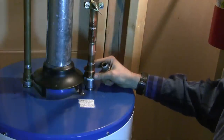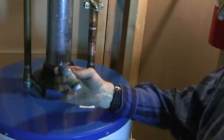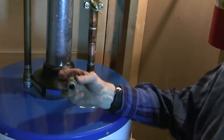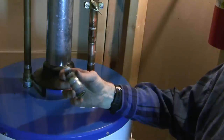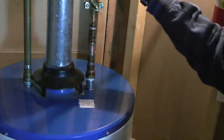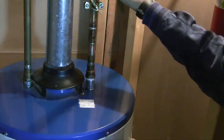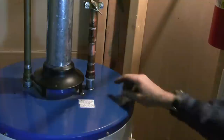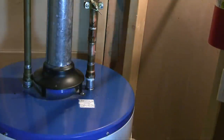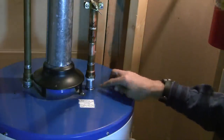We've just changed out the dip tube on my hot water heater. Judging from the condition of the original dip tube, I'm sure this is going to give me a performance enhancement — we'll have hotter water and hopefully the water tank will seem to last longer. The last thing I need to do is check my connections, so I'm going to open the water and watch for leaks. For the next couple of days we'll be watching down below as well, because there could be a pinhole leak down near the insulation that might leak downward. Thanks for watching.